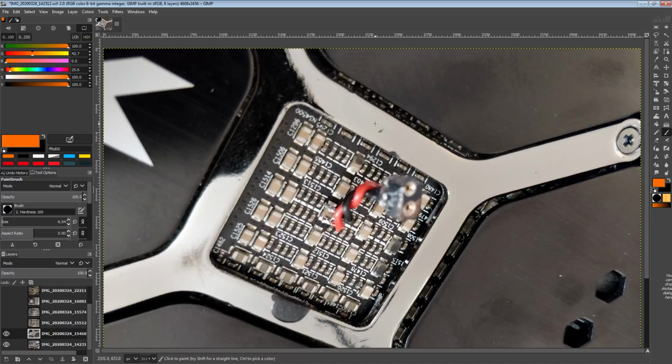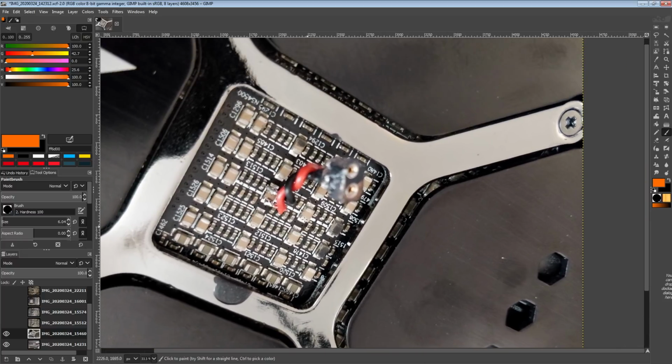When I do CPU measurements, you can actually see the VRM switching noise if you look for it. But with the GPUs, I can't find it, which is just a benefit of how GPUs are laid out and where you measure from. If you measure from the back of a motherboard, it's also not really a concern to pick up VRM switching noise. But the problem with measuring on the back of a motherboard is that you're measuring from behind the CPU socket, and the socket is this great big awful resistor,